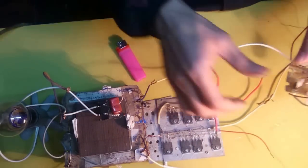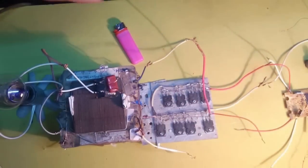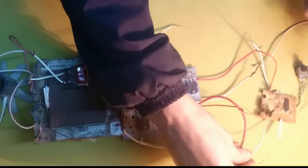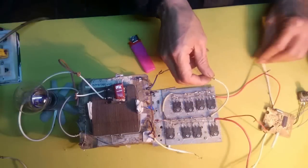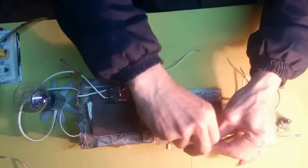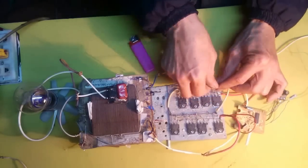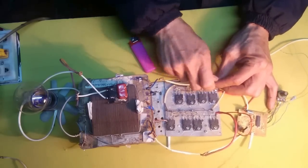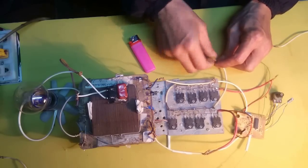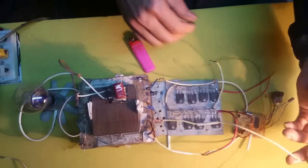You can add an inductor coil at the output of the power driver to filter the current and reduce high-frequency components. Connect the E pin of D613 to the B pin of the power amplifier board. The D613 has two E pins — connect them both to the two B pins of the power amplifier board, going straight to the outer terminals of the transformer. For ground, connect the E pins of the power amplifier and the ground of the control board together.